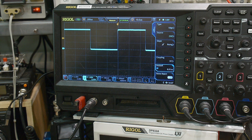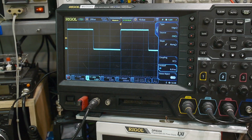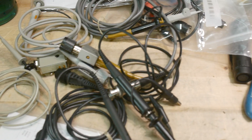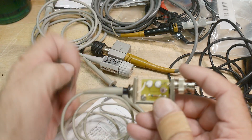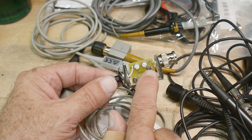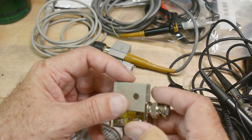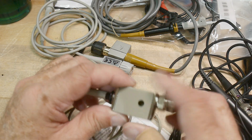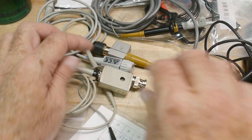What does compensation mean? Scope probes have to handle low-frequency and high-frequency information, and the capacitance of the probe and other factors need to be balanced. Compensation is balancing those things out. If you want to look into scope probes more deeply, this particular probe actually has three adjustments - the one you normally access and two others inside - though accurately calibrating it really requires good test equipment.